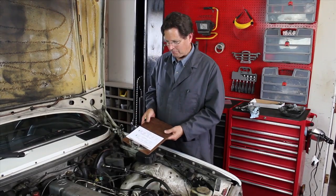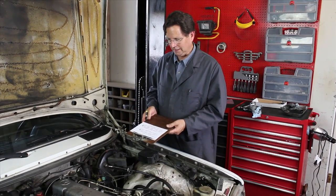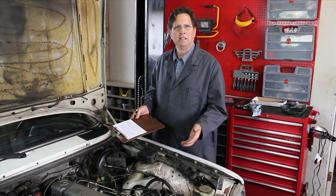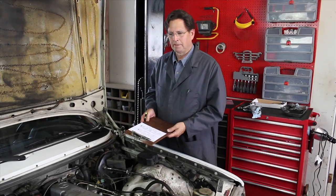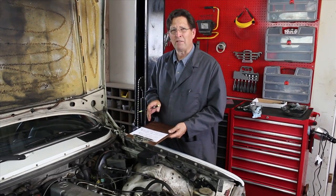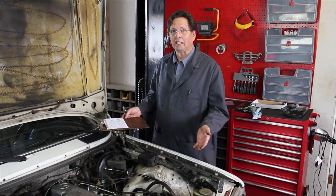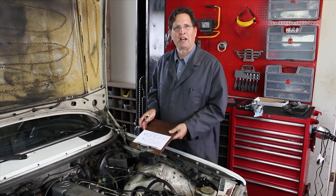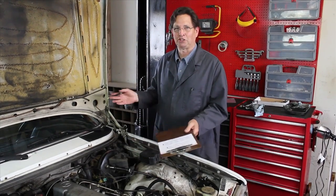I'll never forget the time an owner came to me and said, "Hey, the dealer just told me I need a complete overhaul on my engine." And I said to him, "Well, how come?" He said, "Well, they did a compression test and the compression's bad. So it's going to cost me about $6,000 for them to overhaul the engine." I said, "Do you know if they happened to do a valve adjustment before they did the compression test?" "No, they didn't say anything about that." So I ended up giving him a set of my wrenches. He went and adjusted his valves, and sure enough, upon rechecking the compression, the engine was just fine.